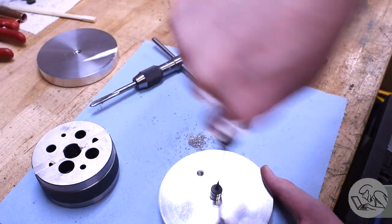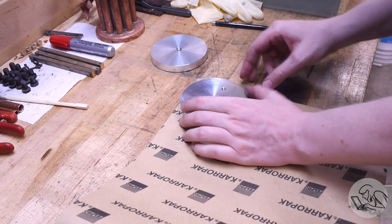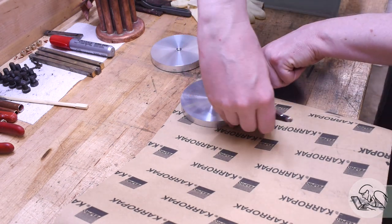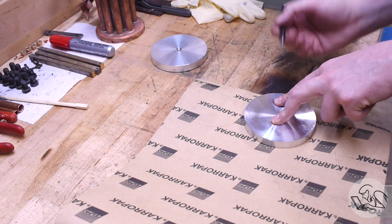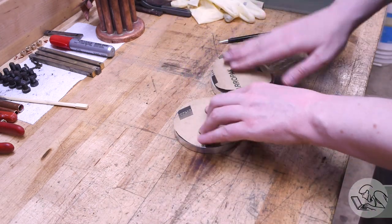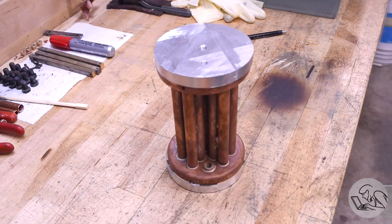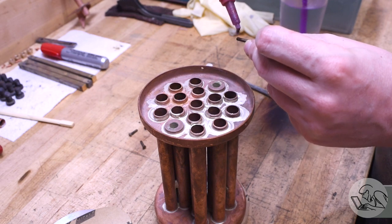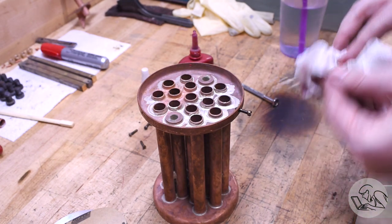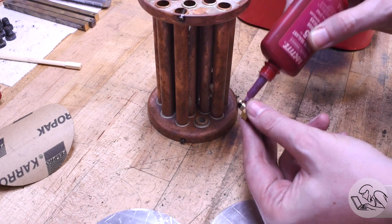After a quick deburr, those plates are done. The top needs a fill hole and a vent hole — that's why there are two. For a gasket I'm going to use Felpro paper gasket material. Paper gaskets are extremely high-tech these days — most of the gaskets in your car are probably paper. I've run this stuff up to 60 psi on my steam engines no problem. I'll mock this up and see if it works. Those stud holes I mentioned need to be plugged — they're the reason I couldn't use an o-ring — so I'll put some Loctite 545 on some screws. Loctite 545 is pretty amazing stuff; I've seen it fix leaks much worse than this.